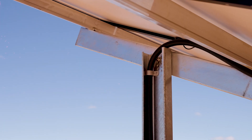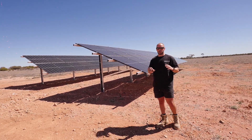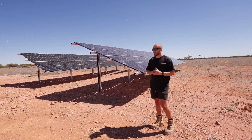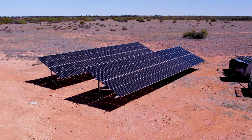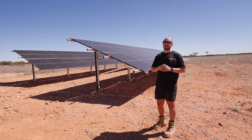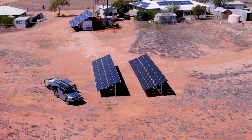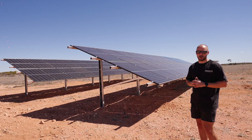We also used S-Rack racking — shout out to Darrell from S-Rack, thanks for the help with the design. S-Rack are really good; they help you with the design for the location, wind loadings, and the panel types as well. All distributed through our wholesale trade zone. So with the S-Rack mounting solution and 52 panels, we've got two arrays — each array wires into each MPPT facing dead north for max production, max sun hours for charging and supplying the loads of the homestead. Take a look at it — it's pretty slick. Team did an absolute belter of a job here.